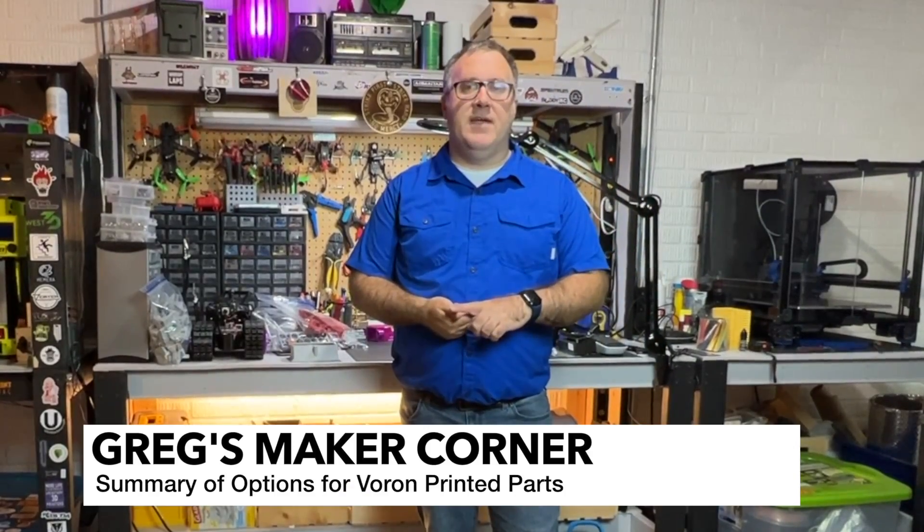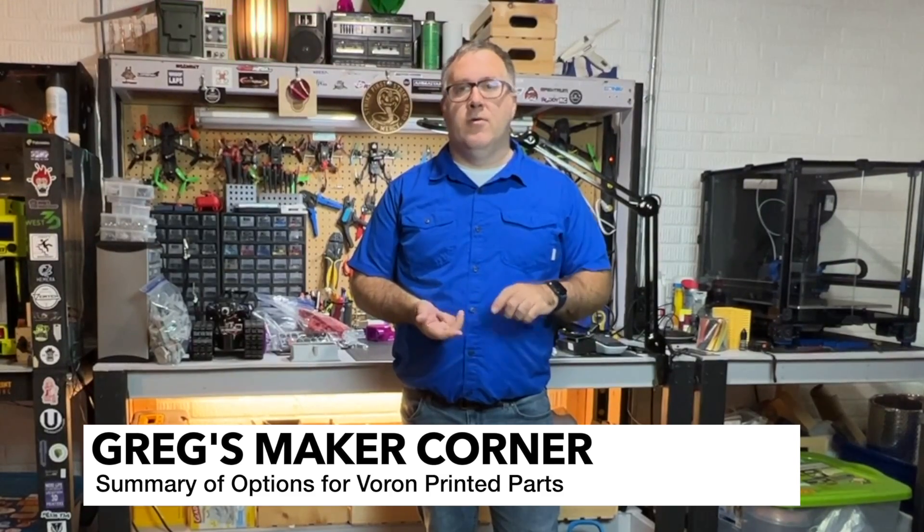In summary, you have a lot of options: buy your parts, use the Voron Print It Forward program, or print your own parts. If this is your first Voron build, you should definitely consider buying your parts — when you factor in the cost of filament, failures, time to print, and calibrating a non-Voron printer, there's a strong cost-benefit to using a provider like Boxy Prints. If you already have a Voron, are an experienced builder who likes to tinker, then go ahead and print your own parts and enjoy the calibration process. Somewhere in the middle, if you want top-quality parts with confidence and are willing to wait in line, the Voron Print It Forward program is great — there are providers all over the U.S. and the world, and you'll likely save some cost.